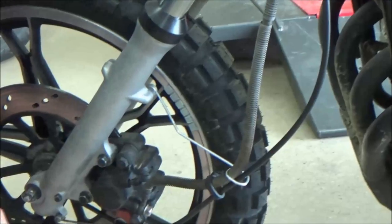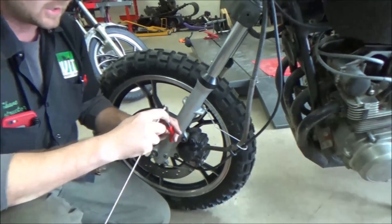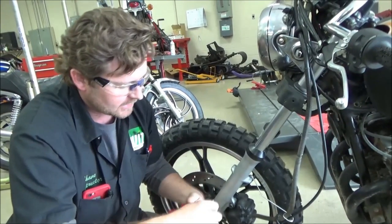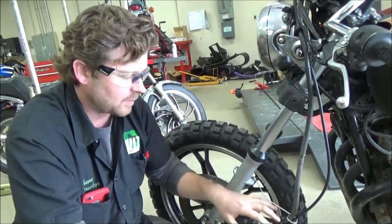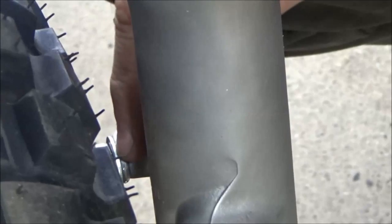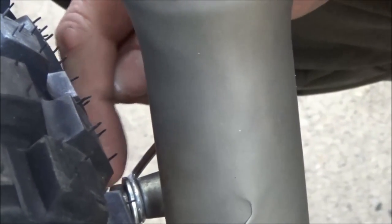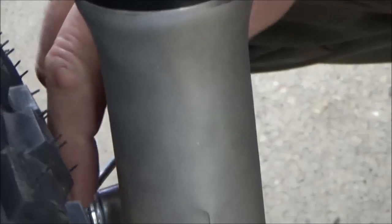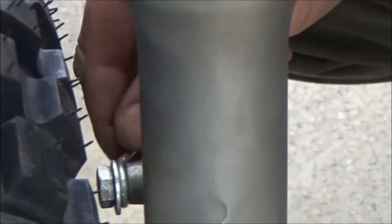What we did is take a welding rod and just loop it around — do whatever you want, come up with any size. It's nice to make it out of aluminum first because it's really easy to bend and you can come up with the shape you desire. You can see here where we put a washer and didn't just smash the screw right through the wire, because that would spread the curl right back open. You want to have something to pinch against it.